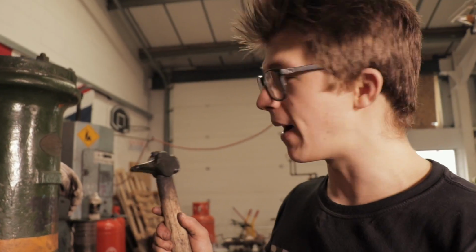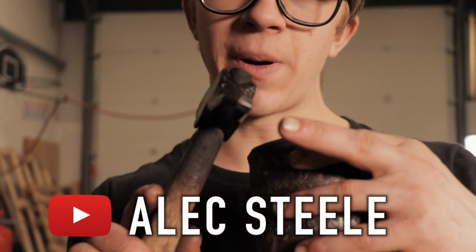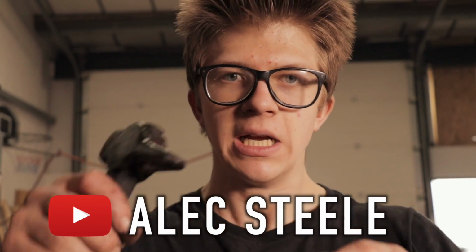This is a hammer eye punch. So this punch, driven into the material, pushing it either side, means that we can get a hole in there with an extremely small amount of material loss. You're going to see in a second, we punch out this little plug.